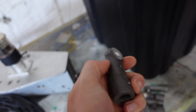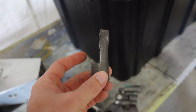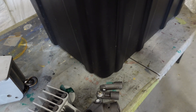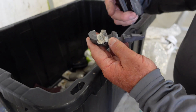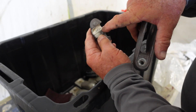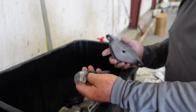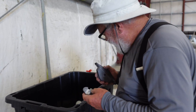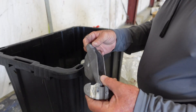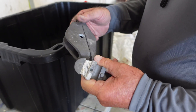Tim was saying this one actually had to be cut off because you can see there is a little bit of a bend there — not quite supposed to be there. And here are the spreader ends — this is oxidation where the wire sits in the spreader. You can see the lay of the wire from the oxidation right in there. That would be a left-hand lay wire. Here's the sheave box for the Genoa — sheave's out, new sheave will be pinned, and the pin's getting cleaned. Lots of signs this poor mast has been used a lot over the last eight years.